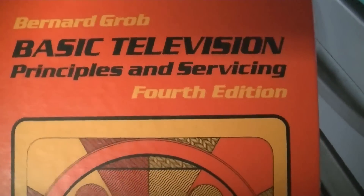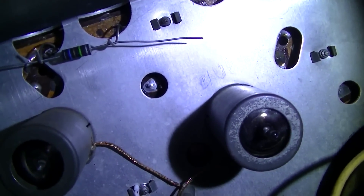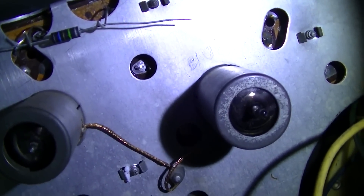According to this book, what those peaking coils do is basically amplify the high-frequency response of the video IF signal — they help improve it. I went through the bandwidth test and looked at the fine lines, changing the peaking coils by sticking new ones into the wires I left sticking out. I didn't see much of a difference at all between a straight wire, the 0.56, and the 5.6 from my electronics store. So I'm just going to put the 5.6 from the store in there. I also tried the factory one out of my GE set, and it looks the same — I can't see a difference.